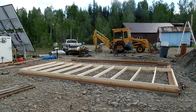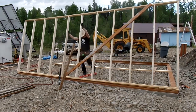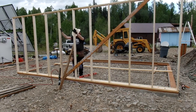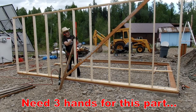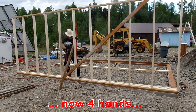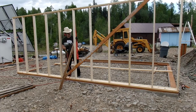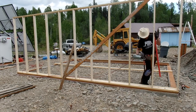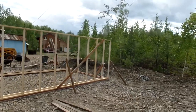I put on a diagonal to make sure the wall doesn't go sideways when I lift it, and it's actually pretty light — 2x4s come up really easily. I drilled holes in the bottom plate to drop in over the anchors. Three anchor bolts basically secure it. The problem is holding it upright while leveling and grabbing the nailer. Planning ahead definitely helps, though it's a lot easier with more than one person — you really need four hands for this part. Once it's nailed in, you want to make sure it can't rack sideways.